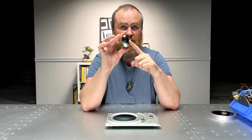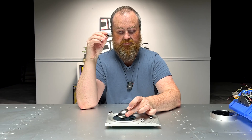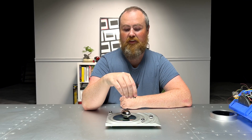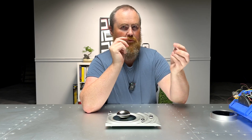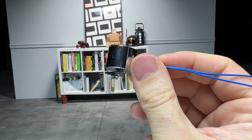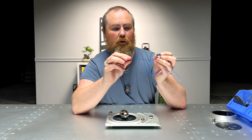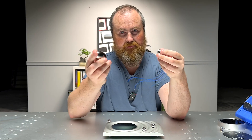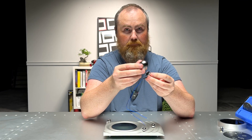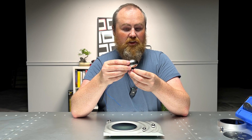Basically what we want to do is turn this into a motor. A motor is just magnets pushing or pulling each other — you can move it with another magnet at a distance. So we put magnets into the egg and turn it into a motor. But the problem is permanent magnets can't be turned on and off — to do that you need an electromagnet. You input current and it generates a magnetic field by having many turns of wire around a metal core. The problem is it's very magnetic and it attracts the magnet — having it nearby won't work well when powered off.